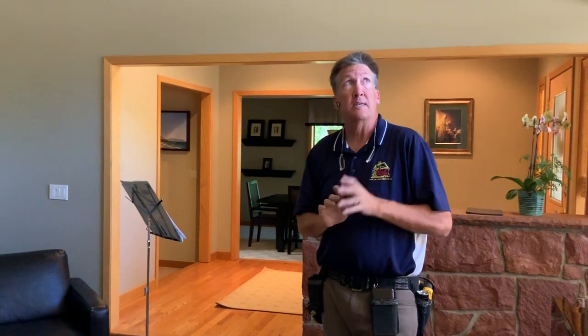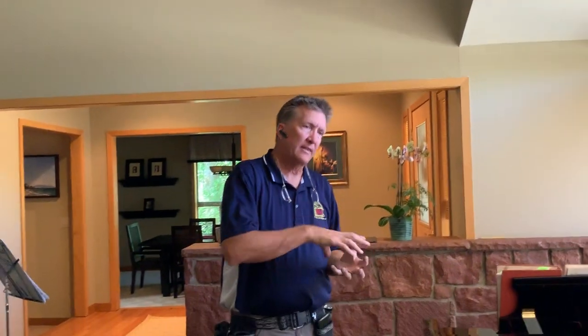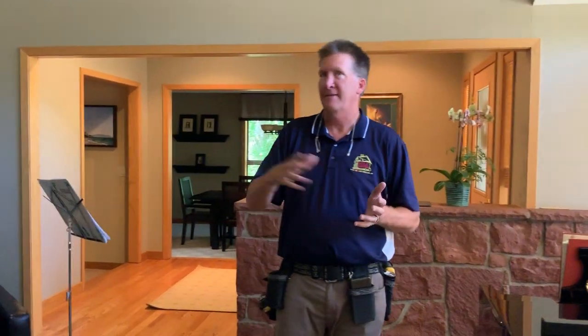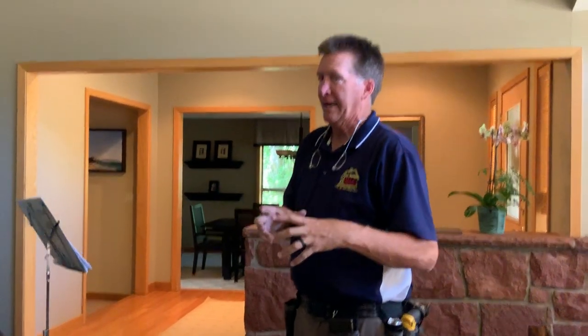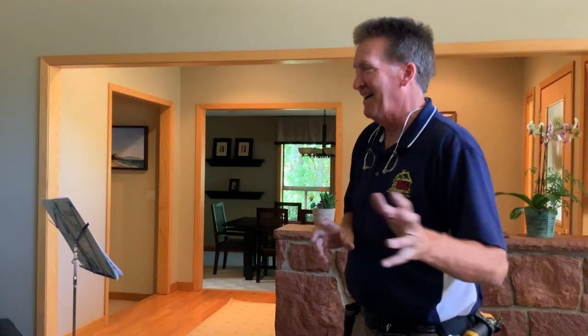My recommendation would be to take all these recessed lights you see like these here. These are the kind that in the attic have to be left exposed because they're so hot. Convert them by putting the LED trims on for $8 each. Now there's no heat, and they're sealed. Then get an insulation contractor up there to put a pristine blanket of insulation across everything. Good idea. Readdress the vertical bats. Yeah, that's pretty inexpensive too. Reconnect one of the pieces of ductwork that is disconnected up there, and get more energy efficiency that way.